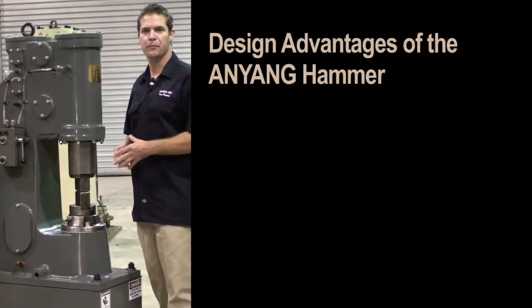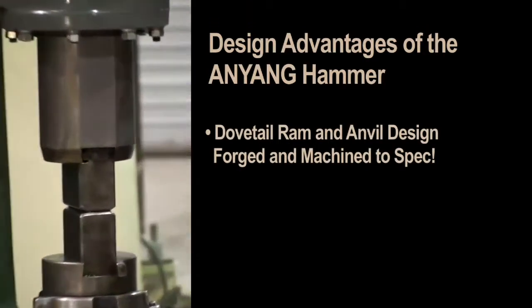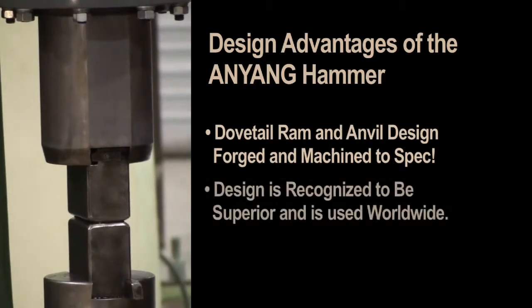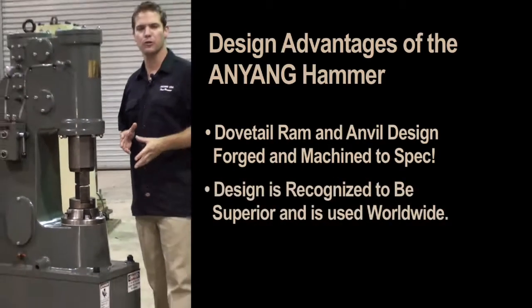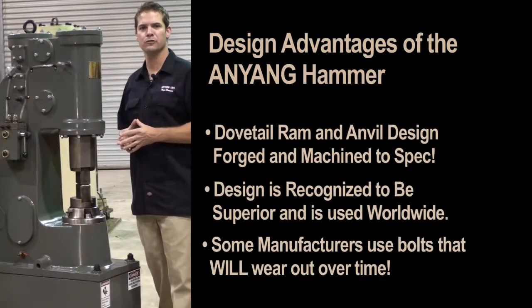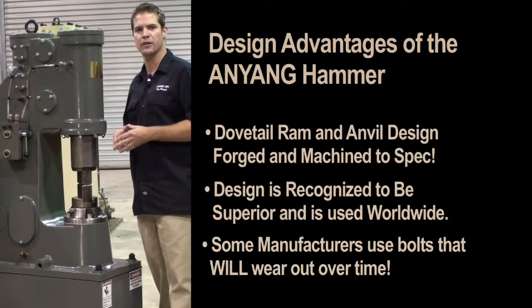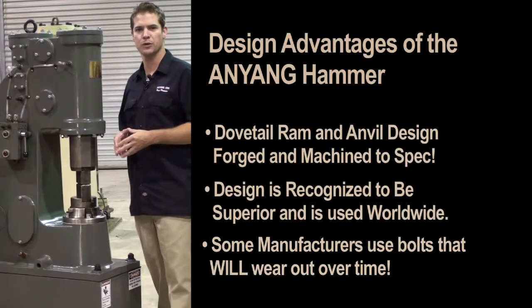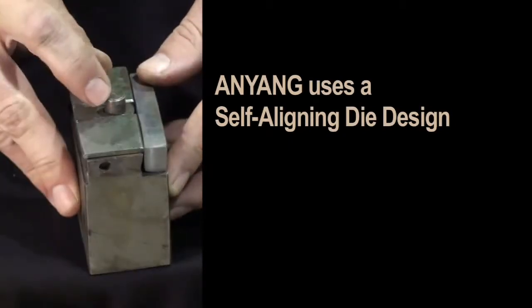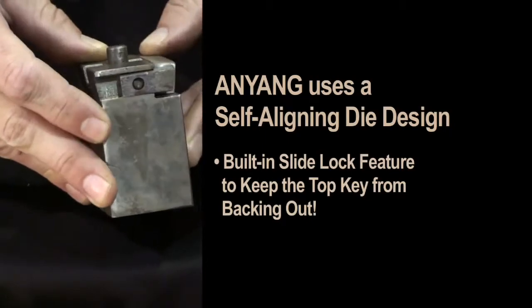Another advantage to the Anyang power hammer is our dovetail ram and anvil design. We start with a simple block of tool steel, then it is forged and machined to spec. This dovetail design can be found on forging machinery around the globe. Some hammer manufacturers have taken a shortcut and are now using bolts that are threaded into the ram and anvil. Years of hammering, mill scale, and constant retightening will prove to be hard on this design. Anyang uses a self-aligning die design and has a slide lock feature that keeps the top key from backing out.